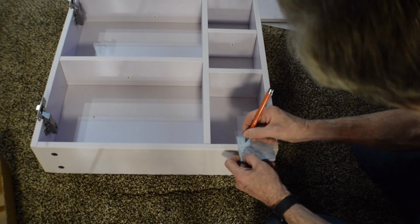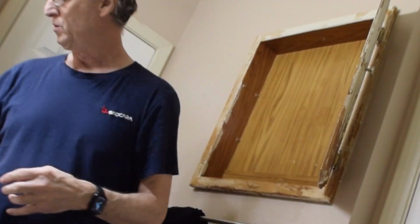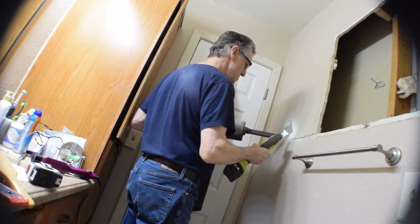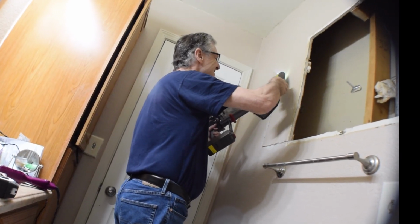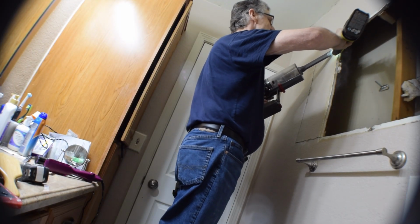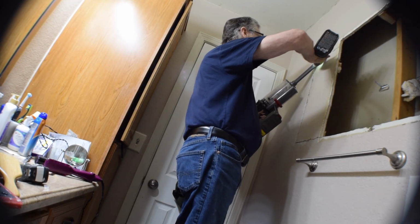So after I pulled the cabinet out, I noticed inside the wall it was double stud depth because of this vent that goes from the downstairs up to the roof. So because I wanted this cabinet to be to the left, I had to build a kind of 2x4 frame inside it that it can attach to, and where I can attach drywall to.